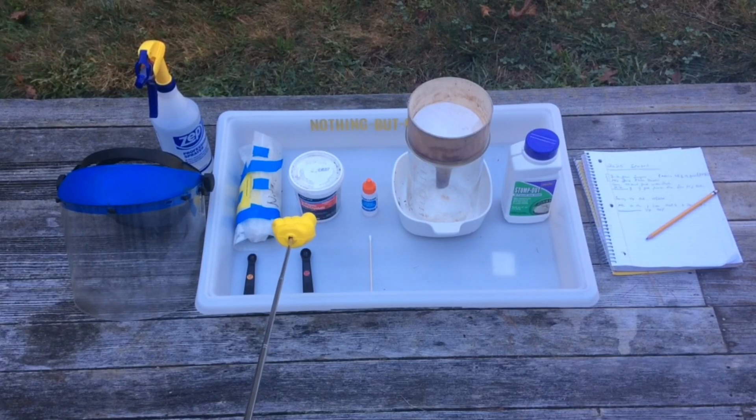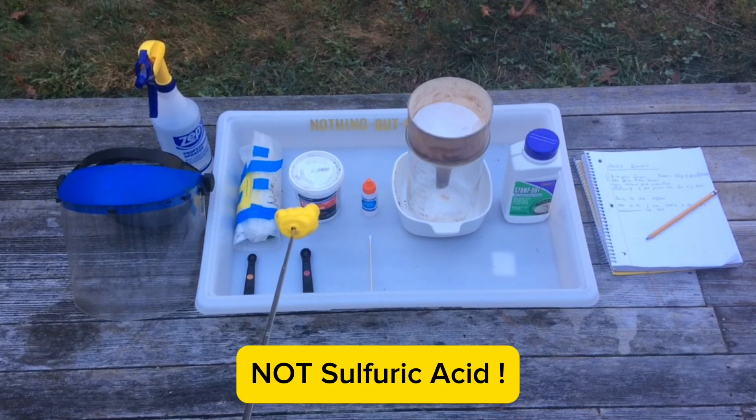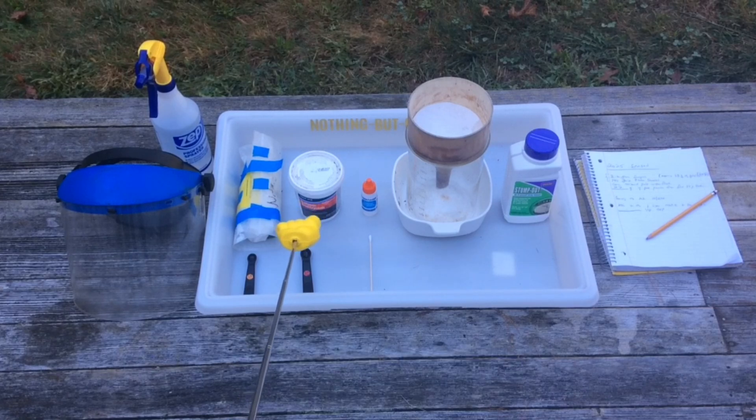This next item is a one-quarter teaspoon. I will use that to add the sulfamic acid crystals to my warm aqua regia once all of the base metals have been dissolved and there are no more orange fumes generated. If you correctly added the sodium nitrate additions properly, you will get no reaction from the sulfamic acid crystals. However, the sulfamic acid crystals can cause a boil up if you have excess nitric in your aqua regia. Next is my stannous chloride and a long handled Q-tip. Next, I have my complete filter assembly ready to go along with my SMB and as always a notebook nearby.